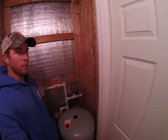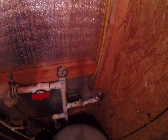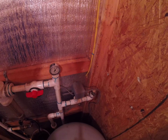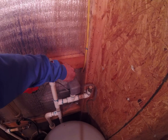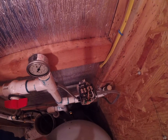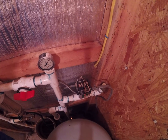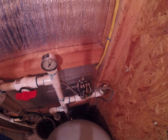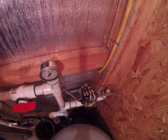Your pump is controlled by this little small box with a gray cover. It's called a pressure switch. Open this up and kind of show you what they look like. Relatively simple — you can see this is basically a water well version of a light switch. The only difference is this switch operates on pressure.